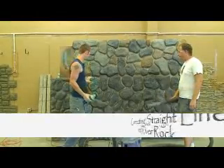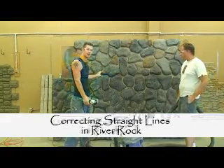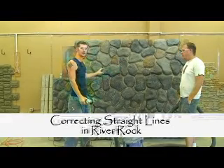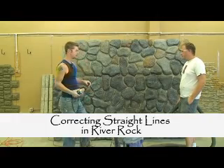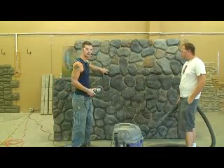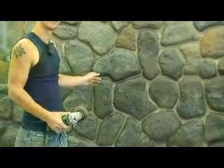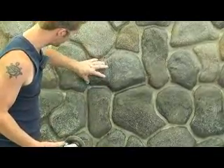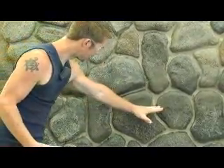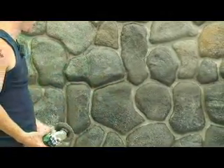What we're going to do right now is — during the class we mudded this and it turned out to be a bit of a straight line. So we're going to show you how to avoid a straight line if you get one. What we're going to end up doing is just breaking it by joining a couple of these rocks together. We're going to cut a grout line right here — turn this into an individual rock — cut a grout line right here, turn this into an individual rock, and then mud the difference between here. Then we'll have a nice break in that line.